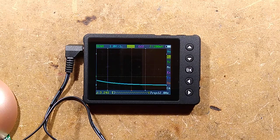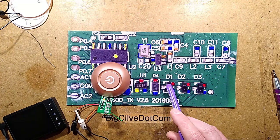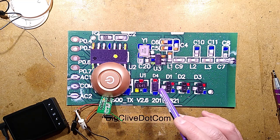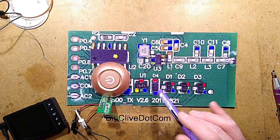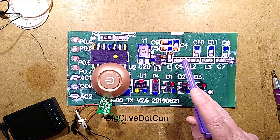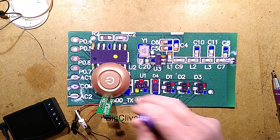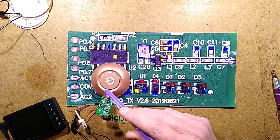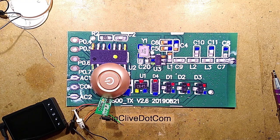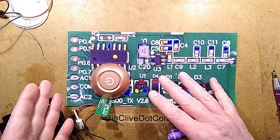So in summary, this thing is a piezoelectric power button. It's got the option for multiple crystal sections - three outputs, only using two - and it looks like a standard piezo disc. The one thing is it's not putting out a huge amount of energy. I tried it from different positions in the house and only got reliable operation when it was in line of sight in the same room. If I took it through to other rooms it was very hit or miss. For that reason, even though the concept is quite nice and it has no battery, I would still rather have one of the battery-operated buttons because it's more compatible with all the other random remote receivers, and the battery is going to last ages in most instances.